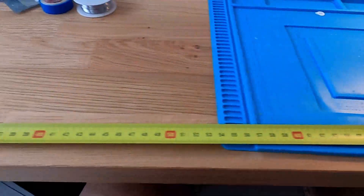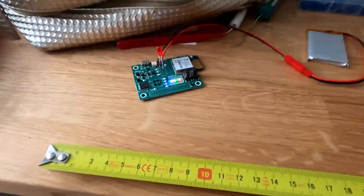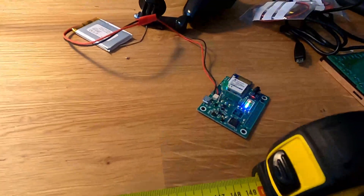We just programmed it, let's test it out. I've got one transmitter and one receiver — the transmitter sends a message with a timestamp, the receiver gets that, sends a message back with a new timestamp, and that time difference with the speed of light calculation gives you the distance. I set it at 1.1 meters. The receiver's LED will always be on if I'm transmitting and receiving at the same device — I can't get a distance if I don't separate transmit and receive. I've got a measuring tape on the desk.